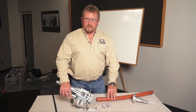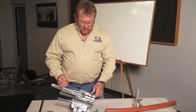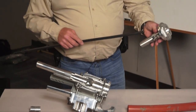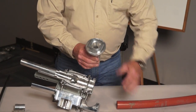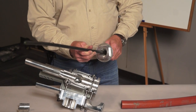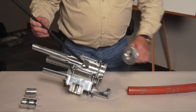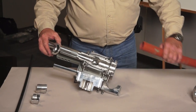This is another air block system. This one is designed to be a lot more precise — it allows us to attach to the inner duct in a different manner. With the other air block, the inner duct adapters that go inside the duct can restrict air due to the cable diameter and inside diameter. When you get too restricted, we lose the ability to get the air down the line to blow the fiber in. With this new air block, we have the ability to clamp onto the inner duct on the outside.